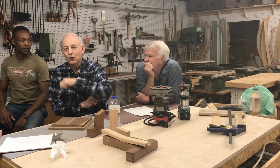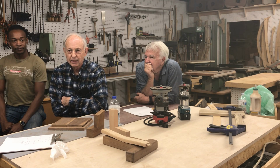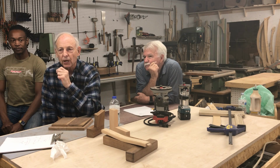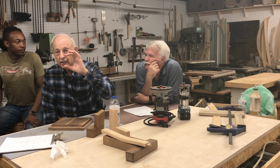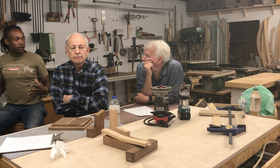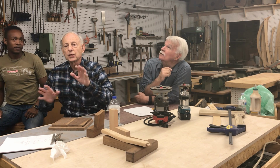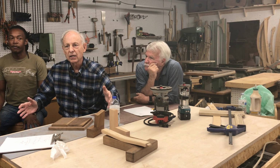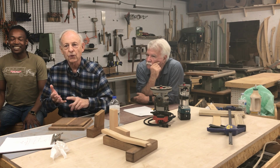I just have to ask you one more question. Okay, go ahead. How thick of material are you gonna cut with your projects? Probably about 3/4 inch will be the average. Three-quarter. There's not much difference though if you get the full size track saw, right? You get a little under 3 inches, 2.5. Well, the reason I ask is if you only have 110 power and you buy a small table saw and you're trying to run 2-inch thick oak through it, you're gonna burn out the motor or it's gonna stall.